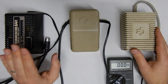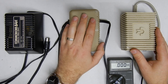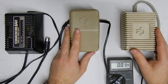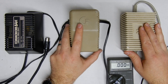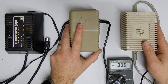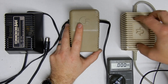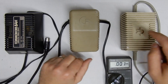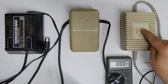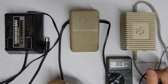Some of these — I think these two — it may be possible to replace the 5 volt regulated line, so we might look at doing that in a future video. But this one on the end here there's pretty much no chance, being that the entire power supply is encased in resin — potted as they call it. So we might be able to do something with the other two, but if this potted one's not working, it's going straight in the bin.